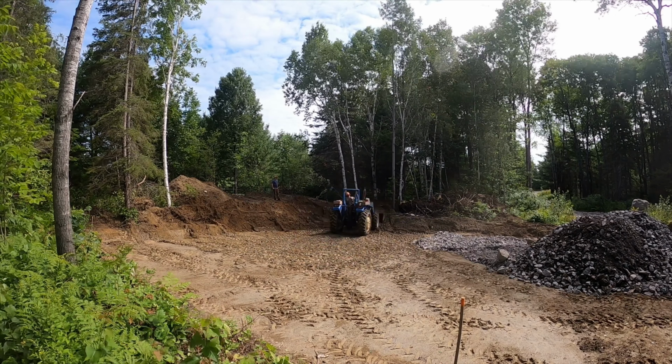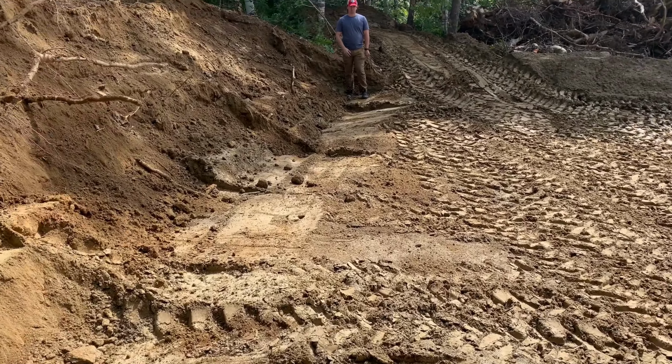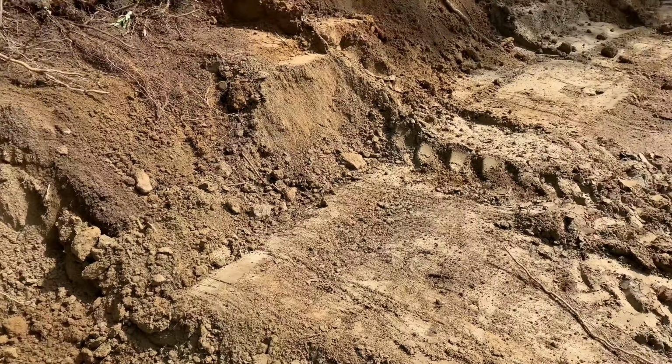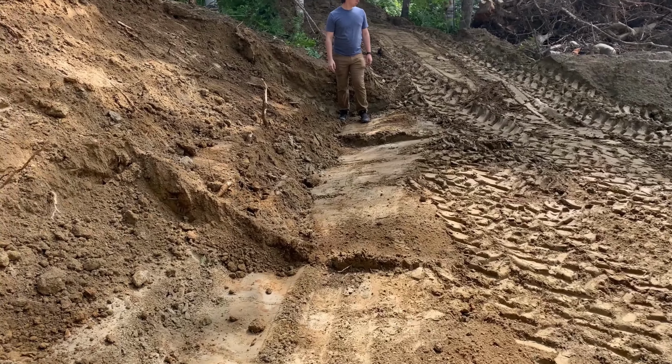Okay, so Elijah and I just ditched this thing. You can see that any runoff here is not going to make it into the foundation. It's going to be going down that way. We'll take a shovel and kind of level that off a little bit, but it'll be filled with 6-inch minus. It's not going underneath the foundation. This is exactly what they want.